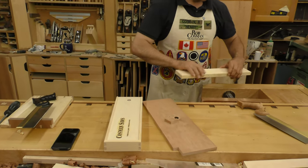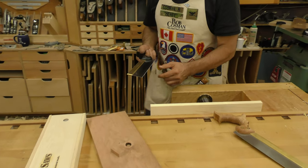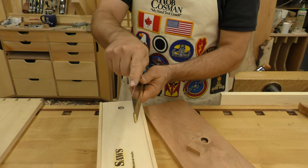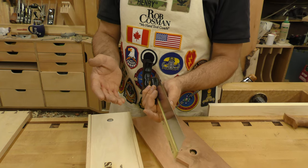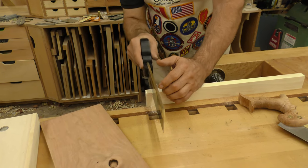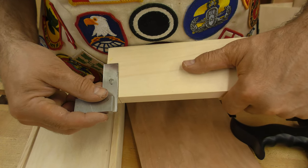Now, the crosscut saw — you're doing the shoulder on a tenon, part of a mortise and tenon joint. You want to be able to get a surface that you can then join to. Nice thing about this — the saw plate is 20 thousandths of an inch thick, it has 15 teeth per inch, and the set of the teeth, meaning each tooth is bent one side or the other, is just two thousandths of an inch. For reference, a piece of writing paper is four thousandths of an inch, so consider half the thickness of a sheet of paper on either side. What that means is, once you start the saw, it doesn't take very much before the kerf takes over — you can close your eyes and finish the cut, it's going to continue going in that same direction. And if you put a straight edge alongside, you'll see how nice and straight a cut you get.